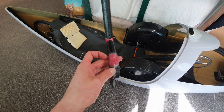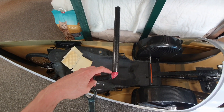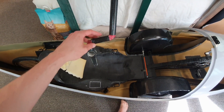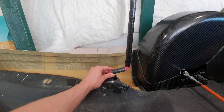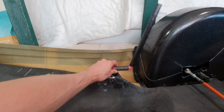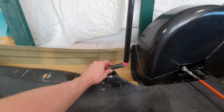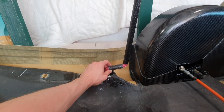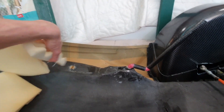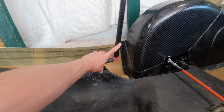I've mocked up the left side steerer and I've gone with 10 degrees off 90 degrees here, just so it gives me a little bit more reach forward. That's where it's going to sit in a neutral position, then all the way back, all the way forward, and full lock each way. I'm probably only ever going to use about that much rotation, and it'll be perfect. When I'm sitting in the bike it's nice and comfortable and I can rest my elbow just here — I can put a bit of foam there — and I get a good grip. It's long enough that I can mount my brake calipers wherever I feel like.